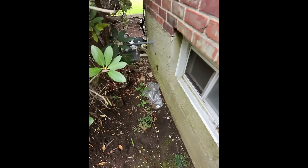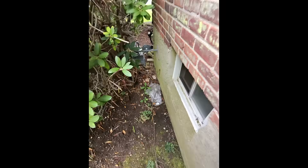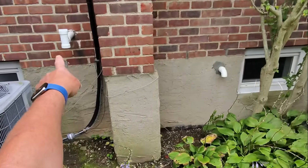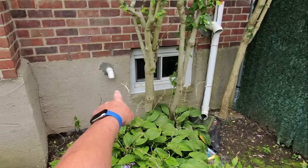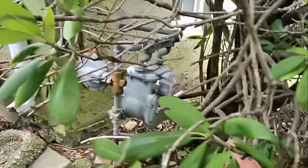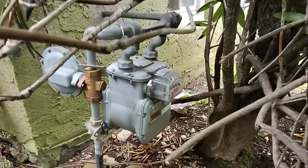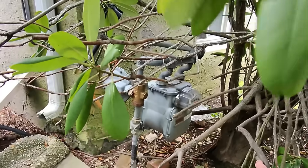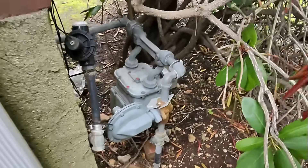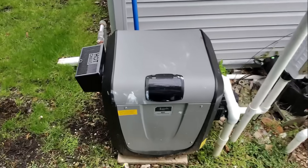There's the gas meter. I've got three-quarter inch going into the house, and without even going inside there's a high-efficiency vent for something, another vent for something, and that's definitely an exhaust. I'm taking a look at this gas meter — it's rated at 250. And you wonder why the pool heater is not working.